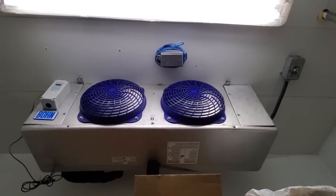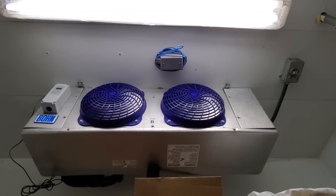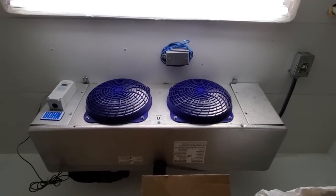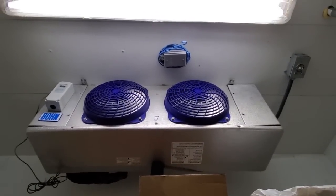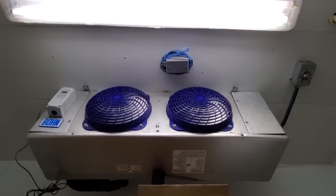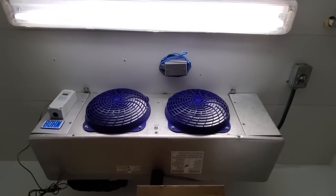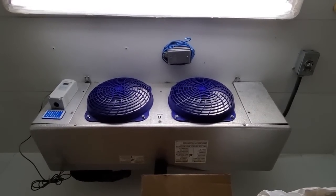So today, this is an interesting service call. We did a repair on this walk-in freezer last night. We had an emergency overtime call and found that the system was completely out of gas. We found a major leak at the dual pressure control, replaced it, vacuumed it down, got the unit running, and then I came back out to do a follow-up this morning and the box was not down to 10. So let's go up onto the roof and see what we can find.